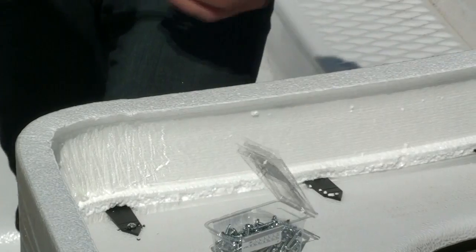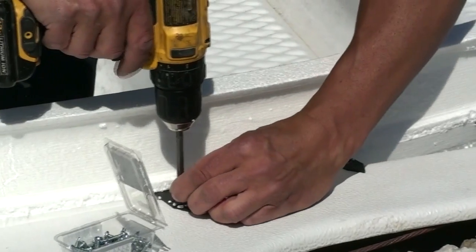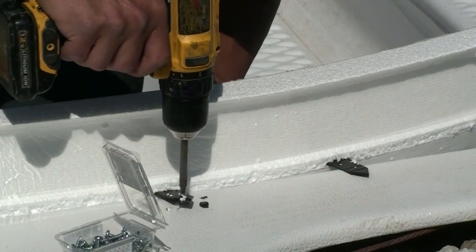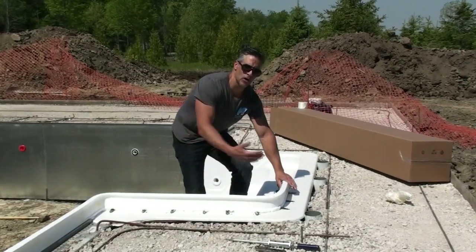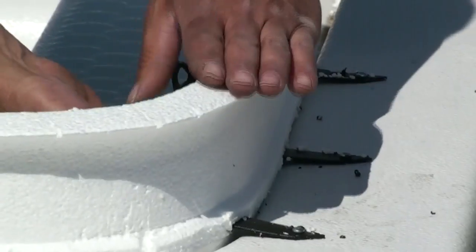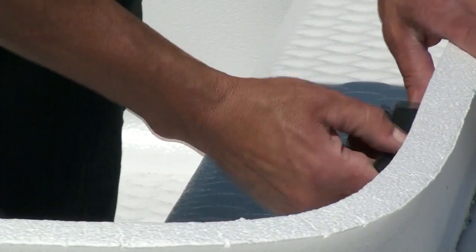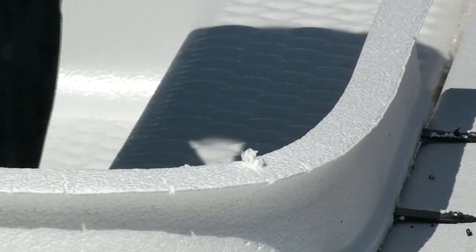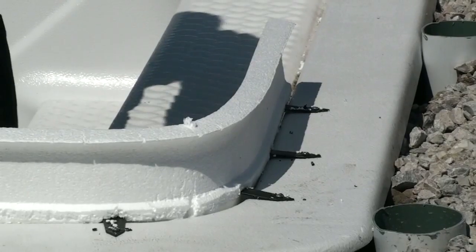And that's it. I'm going to show you what's going on underneath the concrete. When you're ready to strip these after the concrete is hard, you basically rotate these and pull them right off. The one thing with our system is that because we don't have two-way tape, you'll be able to strip these off in a full eight-foot piece.